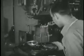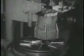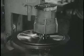Looking through the magnifier, I saw the rotating grooves of the music itself caught on the record. Carefully, the technician centers the disc and with the lens he checks again. With the position of the hole accurately determined, he drills it with infinite accuracy on dead center.